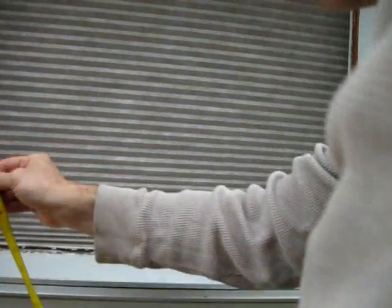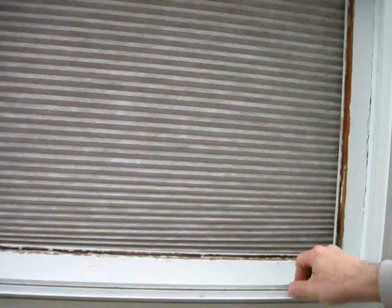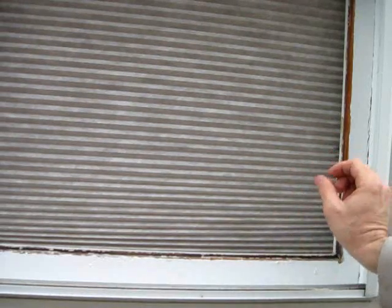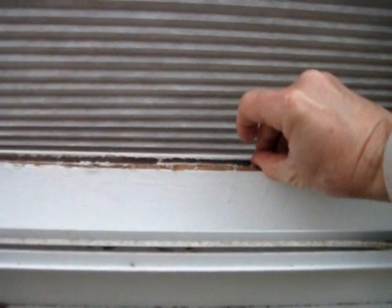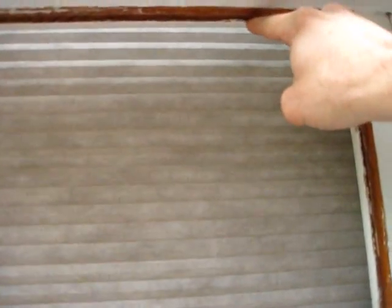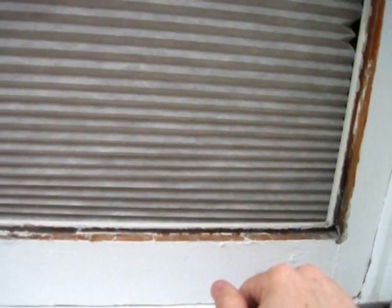It's basically 24 inches. So I have 30 inches by 24 inches. What I'm going to do is reduce the cut by an eighth of an inch on the bottom and the sides, to make sure I can get the glass in properly. I don't have to be 100% perfect — I still have this lip, that's my fudge factor. As long as the glass doesn't slip from the bottom, sides, or top, an eighth of an inch is just fine.